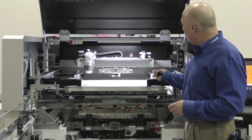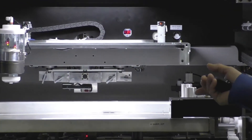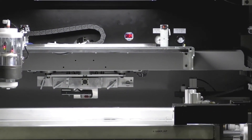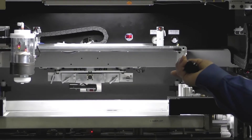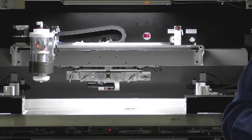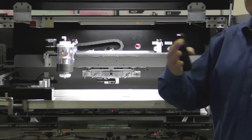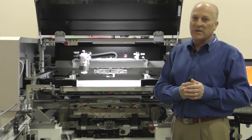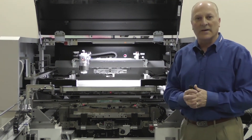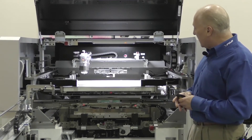Pressure control is a closed loop system, as you can see here with the gauge mechanisms. The two squeegee systems are set with fixed angle of attack configurations, so they're quickly adjustable by just changing your blades out. The pressure control is constant — we have a range from 10 to 250 newtons of pressure, and it's programmable. It is not only just a pressure for the stroke process, but if there's warpage and variations in your board surfaces, the pressure system is designed to keep that constant pressure throughout the full stroke, so you're not missing out with voids or excess print. As you can see, very simple, easy access for all the maintenance applications.